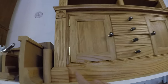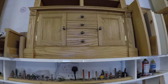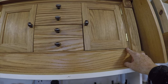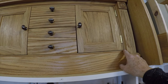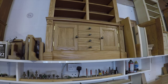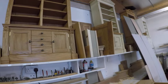This is the bead frame here. I think I've done a video showing how to make these before, but while I'm doing this video, I thought I'd give you a refresher. It sets off the unit, really. It's a traditional way of doing it with a traditional hinge. A lot of the doors that I put on now will have the concealed hinge with a soft close on it. So if I wanted to, I could hinge it off the side of my old column. But aesthetically, it just looks so much better when there's a bead frame that comes around a unit. And it's very traditional. You see the old guys back in the day, they would have this framework that would go around the opening of doorways and drawers.